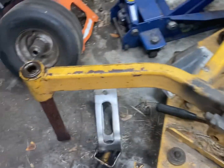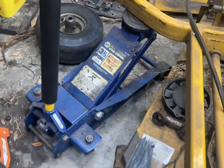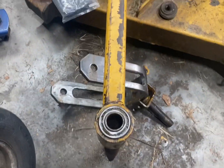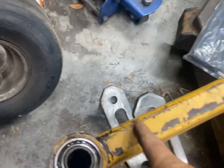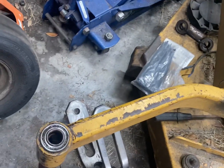If you want, you want to limit it. If it pops out, you don't want the whole machine to drop on the ground. So you put a jack or something on one side so that it can go the amount that you want — just a couple of inches — and then knock it out. If you put a board across here, that's the safest way, but you do dampen the impact.